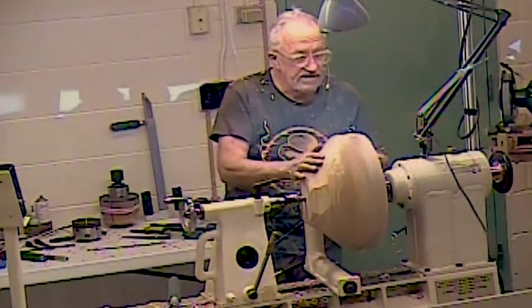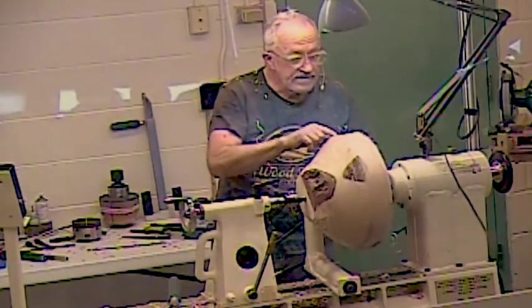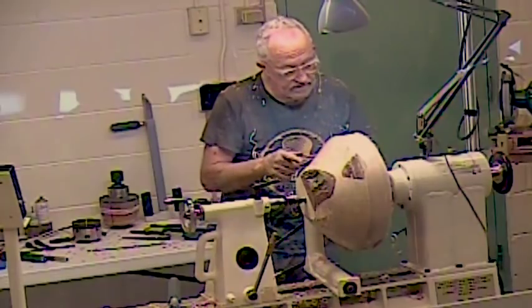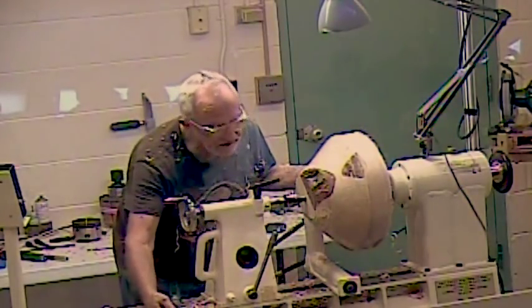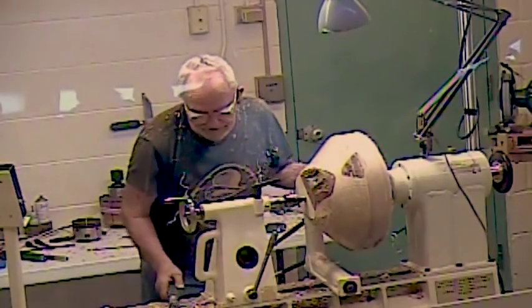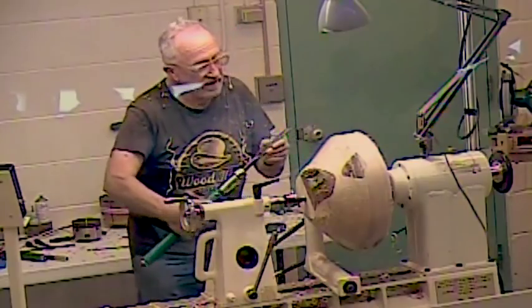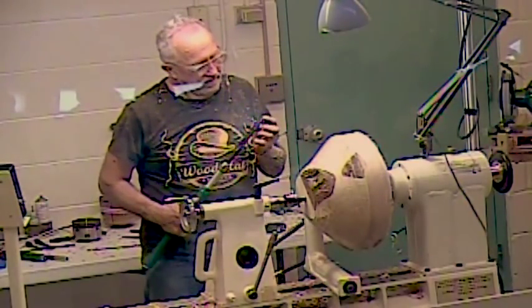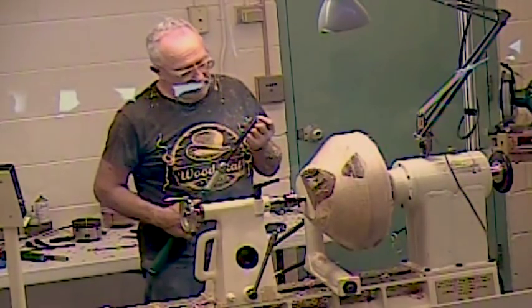We still have a little bit of chainsaw right there. There's a little tear out here because I'm just rubbing the bevel of the tip of the tool. That's not the best cut. You want the cut to happen way along the side here. That's what makes my grind outstanding, because when I grind, I swing past 90 degrees. The side of the tool is not flat. There's curve there. I can cut way back here and get a real shearing cut.